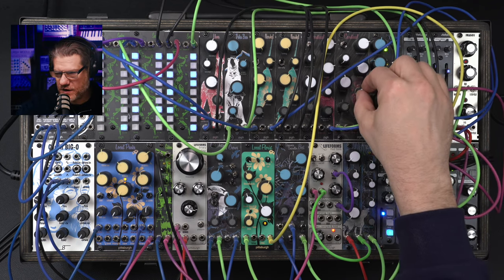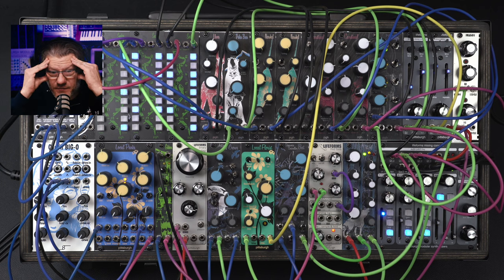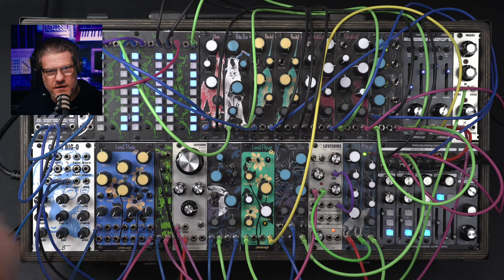What was the hardest module to work on? I was talking earlier about that dub mixer. The dub module is really hard to work on because the signal paths behind the scenes are so confusing. And trying to decide if you have the code routing the analog signals properly or if there's an actual error in the schematic, it's been a lesson in patience.